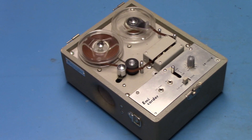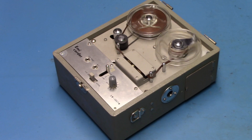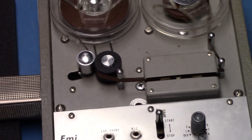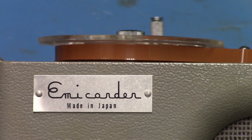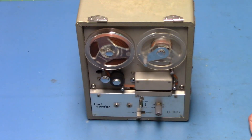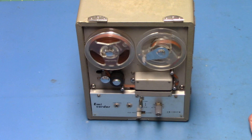On the RCA, he and his assistant erected a 1,300-foot-length antenna pointed toward North America. The antenna averaged 12 feet off the ground and was terminated at the far end with a 400-ohm resistor. This was, and still is, the famous beverage antenna, still used by many amateurs for 80 and 160-meter operation.